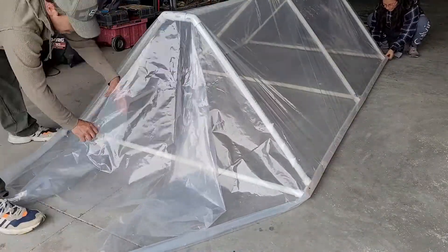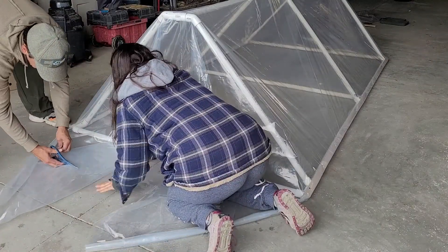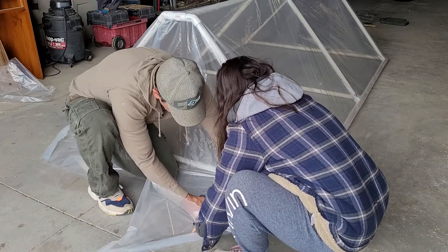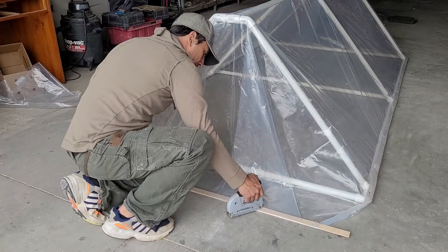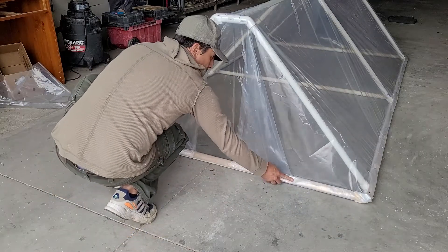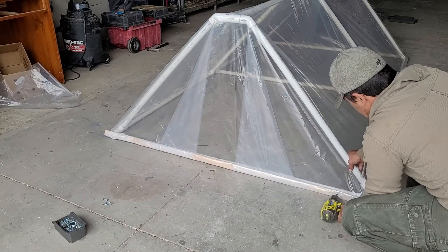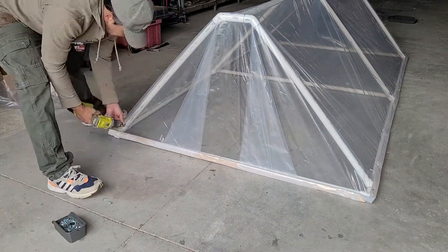The front and back is a little bit more difficult to do. It requires folding the plastic in a triangular pattern that is somewhat similar to wrapping a present. After folding the plastic, I then cut off any excess there may be, making sure to make a nice straight line with at least one foot of plastic sitting past the edge of the frame. Then I staple the edge of the plastic to the wood strip, then begin rolling the plastic tightly until it's even with the bottom of the frame, then secure the wood to the frame with the same one-inch self-tapping screws. For the plastic on the last remaining side or the back side, I just repeat the same exact steps.